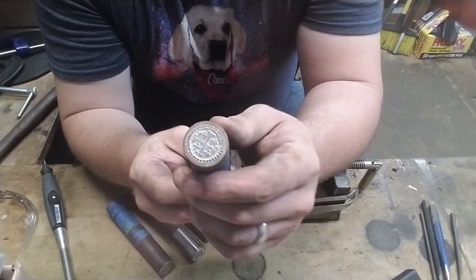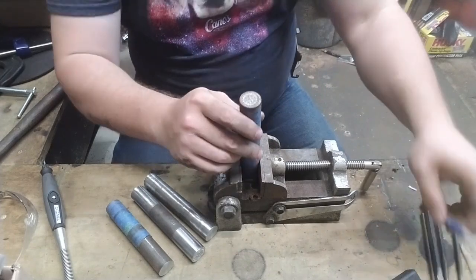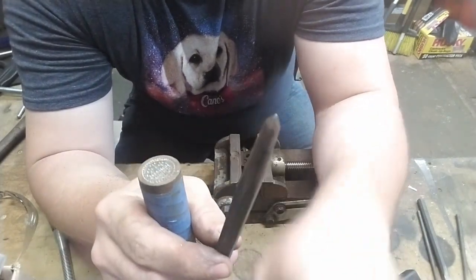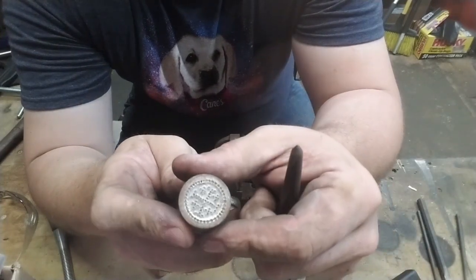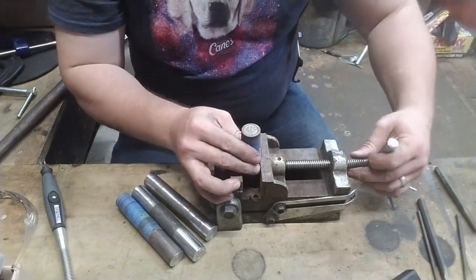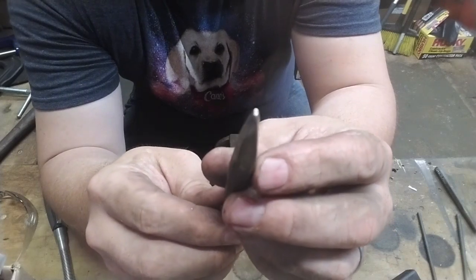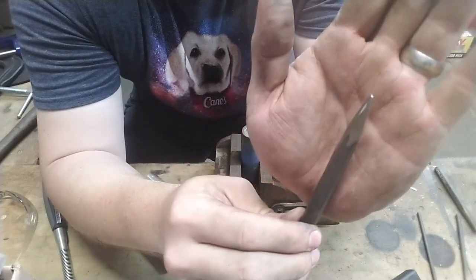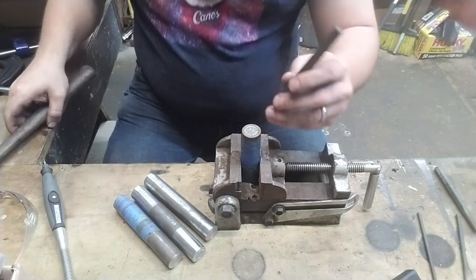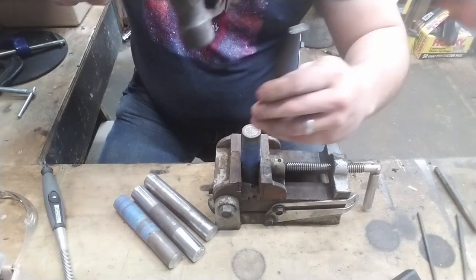We're over the bench. This is an old die I made of a Jerusalem cross, and I tried to make it using only one tool — a center punch tool. You can have different angles ground on your center punch, and in general you probably want a fairly wide one. While the project was more or less successful at making a die with a single tool, I think we can do a lot better. So for that, we're going to use a tool like this. This is called a liner tool, or at least it is in chasing and repoussé. We're going to chase in — or work from the front — to beat in the pattern that I've already more or less marked out with the punch work from the center punch.